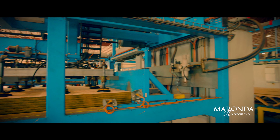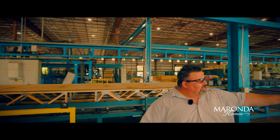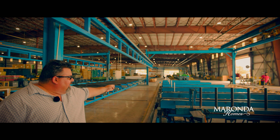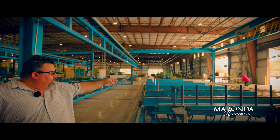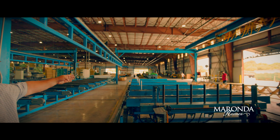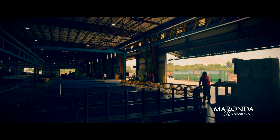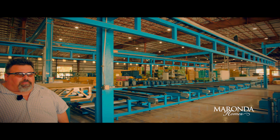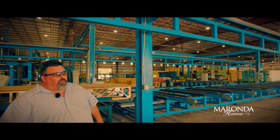The jig pin tables allow for exact calculations to the blueprints — you cannot install anything differently than where they're placed. You can see one jig set up now where our people are erecting those floor trusses, placing them in the correct orientation with the upright jig, then moving them to be placed in the proper orientation depending on the computer program.